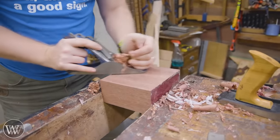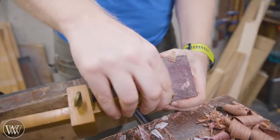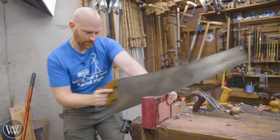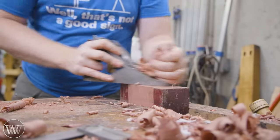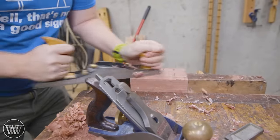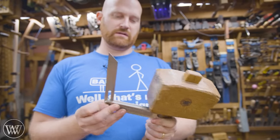With that first top reference, I'm going to use it to square up the side. With two done, I can mark down four inches. This is going to be three inches thick, four inches tall, six inches long. I'll mark all the way around and rip it down. The grain is actually going with the saw — it just looks different due to saw marks. Before going any farther, I'm going to mark the reference face and edge so I know what I'm measuring everything off of.